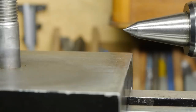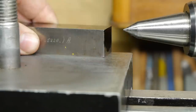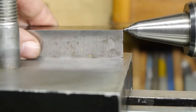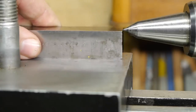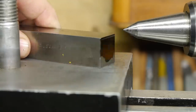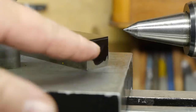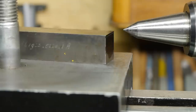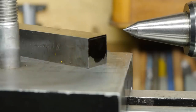Lucky for me — and perhaps also you — I found a large piece of high-speed steel. I think this came with the red Fischer lathe that I once owned. It's two centimeters thick, and as you can see, that's higher than the center height of the lathe. So the pointy bit can be ground down to just above center height, although it will probably take all night to mold this into a fitting boring bar. So coming soon: is high-speed steel really better for a good surface finish? Okay, bye for now.